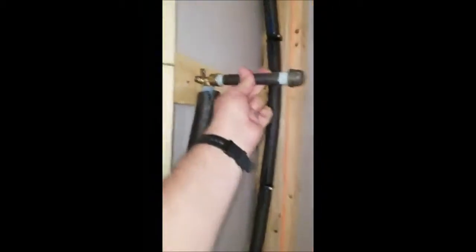There are the baffles again, nail plates — they tuck that insulation in nice. You can see where they've sealed that off on these double stud plates as well. Got the double top plate and single sole plate, or seal plate. Stand-up shower — I like seeing the hard black nipple there. Sometimes they'll use a plastic one and those have a tendency to break, and then you've got water running down your wall until you can get the water turned off.